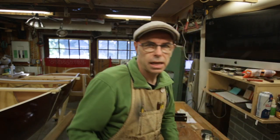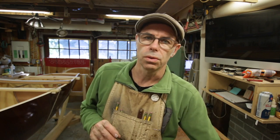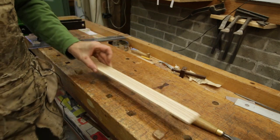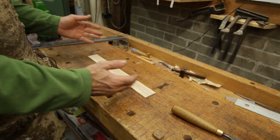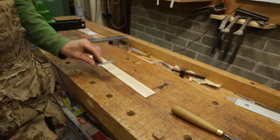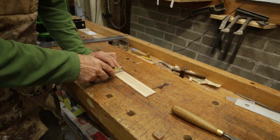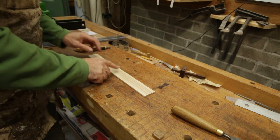That's what I use now, and I've got a fretboard set up here to cut in a moment. But before I do that, Alex was asking about just free-handing it — so if you didn't have all this stuff set up with indexing pins, if you just had a fretboard with some lines marked on it, what would you do? I'm just going to pretend this little piece of ash is our fretboard. I'll show you a good way to help put a saw kerf in the exact spot you want. Suppose we wanted a saw kerf right there — beyond just drawing the line, what I would do is take a knife. This is a technique used in boat building and fine woodworking called protecting the line.